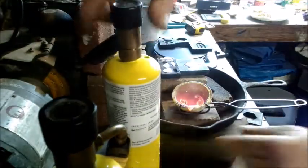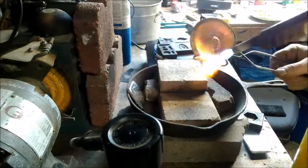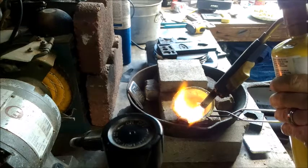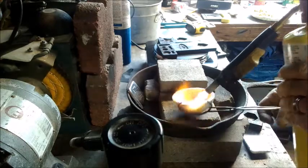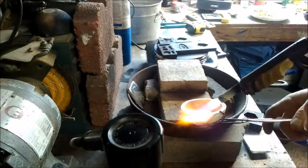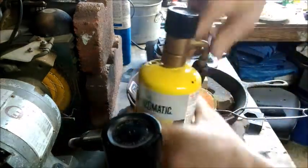Here's kind of what I was talking about — when you don't quite get everything melting enough, it kind of becomes a pain to ream up, because you don't want it to drip over the side and lose it. You've got to try and go slowly; it does take a little practice to not lose it. That's also another reason I use the cast iron dish — I can keep it all pretty much inside and it doesn't stick to the cast iron. There's probably at least an ounce in here that didn't melt or was melted but didn't stay melted.